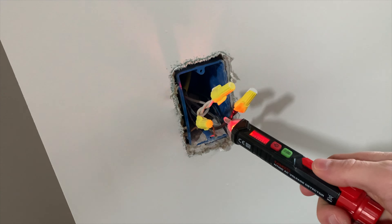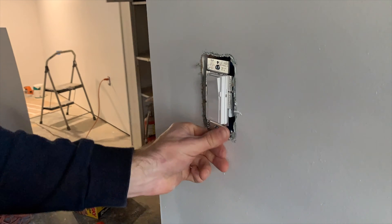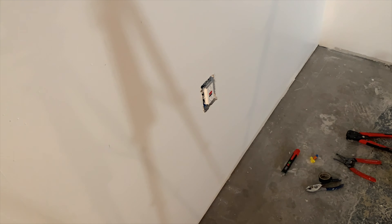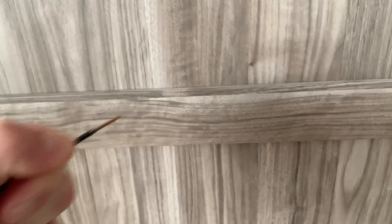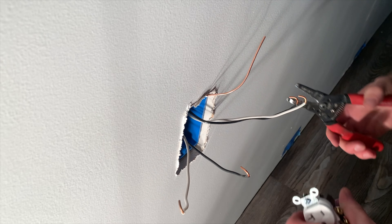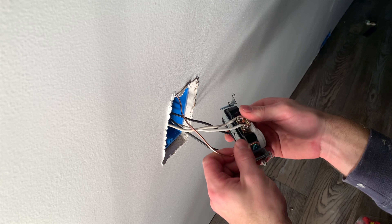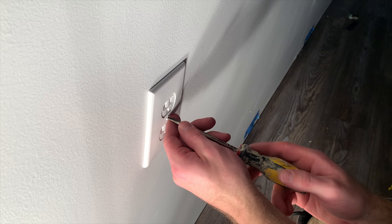In my opinion the rough electrical work is much harder than the finished electrical — after drywall it's as simple as wiring up outlets and switches. I always use my voltage tester and make sure the breaker is off before doing any finished electrical work. I installed dimmer switches throughout most of the basement and then put on the faceplates. I installed a GFCI outlet as the first outlet in the electrical run. When wiring an outlet, pigtail the ground first since only one ground wire goes to the outlet, bend wire ends clockwise, thread black to brass, tighten up, and fix it to the wall before putting on the faceplate.